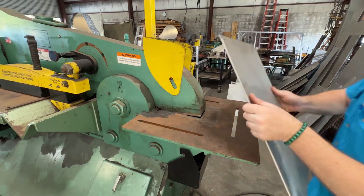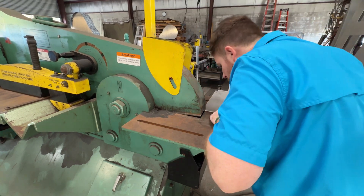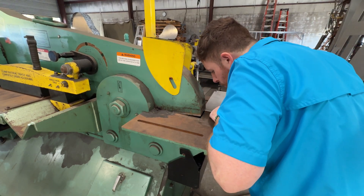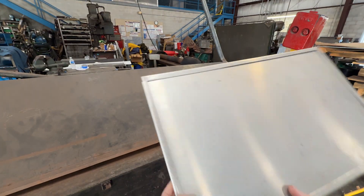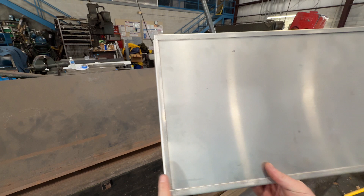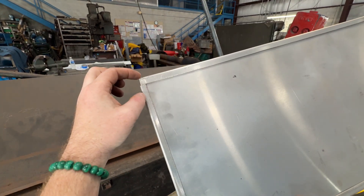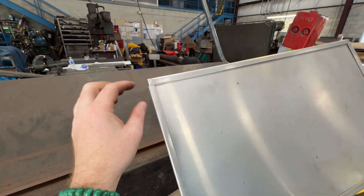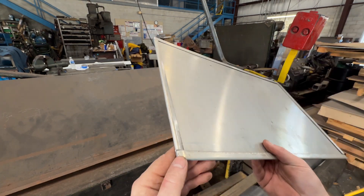The notcher comes in really handy for notching corners like this on sheet metal — good to have. I think that came out alright. We're touching right there — that's why it might have been good to do that second notch after the bend. Because if it shrinks or grows a little bit, you might end up hitting on this and breaking wrong, and that's not good.